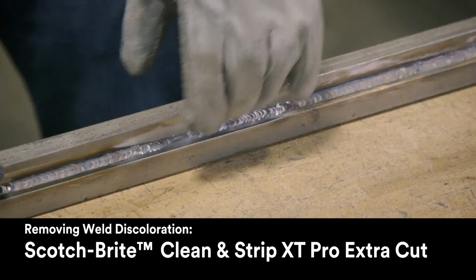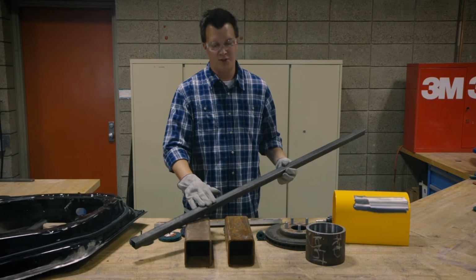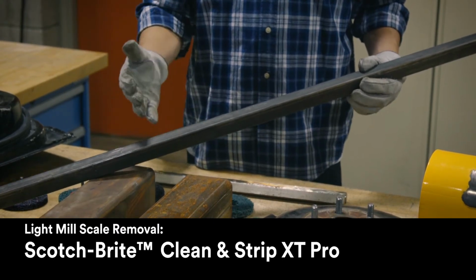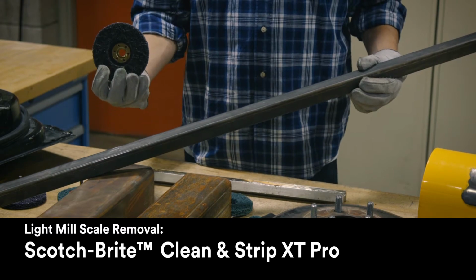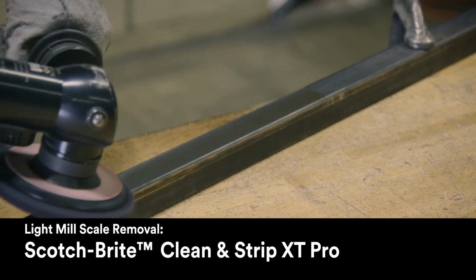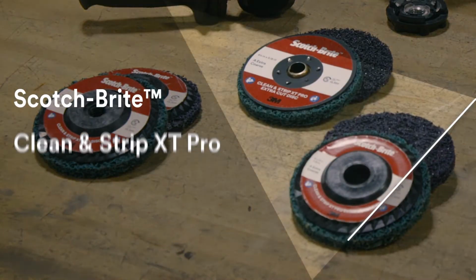If you have an application where you need to remove light mill scale oils and prep a structural beam for adhesives, let's say for instance you're building a utility trailer, we would recommend using the silicon carbide version, XT Pro. Silicon carbide works a lot better on mill scale than aluminum oxide does.